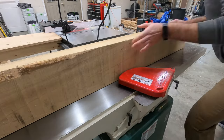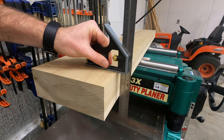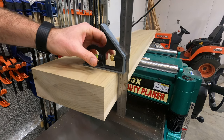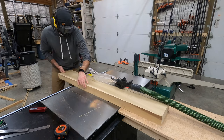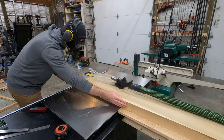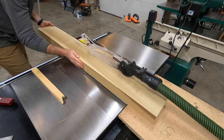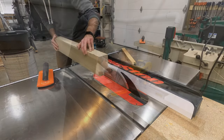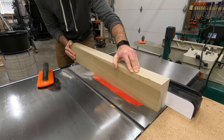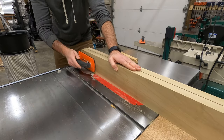The table was almost finished but I didn't like how each piece set all the way down on the ground, so I wanted to add some type of internal brace and support to kick it upward so it sat just a bit off of the ground. What you see here is me taking this giant poplar beam that I've had laying around forever and milling it up nice and square so that I could cut some pieces off to make the frame that will go on the inside.